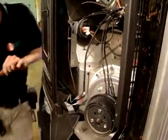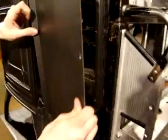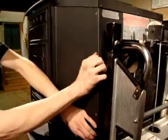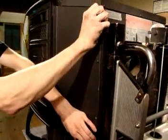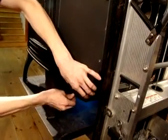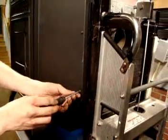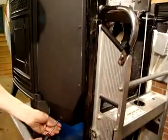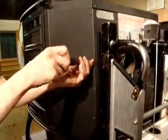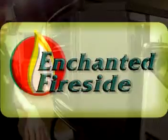To finish things up, we're going to reinstall that side panel — slide that right into place. I like to just get the screws started by hand so you can line up the holes, and don't forget to do the bottom one as well. Then take your Phillips head screwdriver and tighten those down. Now for viewing purposes we have this up on a lift, but when you're in your home you may have to get down on the ground to do this. Once those are nice and snug, you have successfully completed an igniter install.